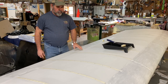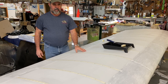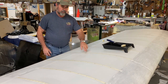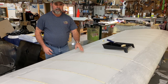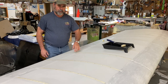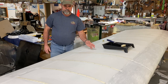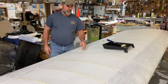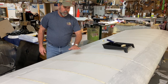At this point we've brushed on the very, very thin coat. Don't mistake this thin coat for when I talk about the thin coat of putting the tapes down — for that you'd be using one part glue to two parts reducer because you're just brushing and trying to get a good bed of glue. This point, like I said, was about one part glue to five or six parts reducer that we brushed in, because you want it thin enough that it's not leaving a lot of glue residue — you're just closing that weave.